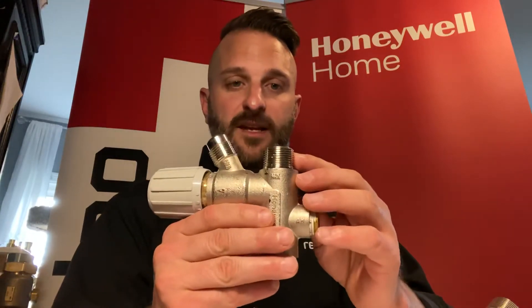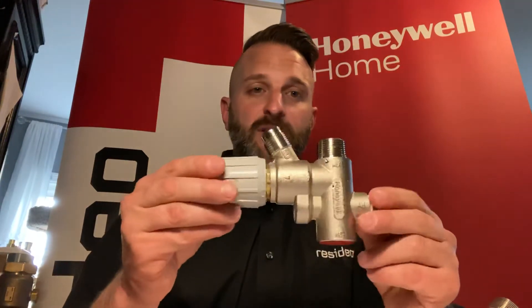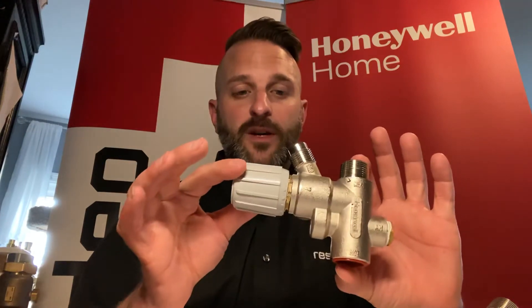On the top on your mix end, this is three-quarter inch male pipe, and then we have a half-inch recirc port with a minimum flow rate of 0.25. We also have a pre-tempered port for a wash-down station — so if you have something that needs to be sanitized, like in a restaurant where you need anything higher than 120 degrees, you can tap into this. Really nice little compact unit that makes installation a lot quicker and easier.